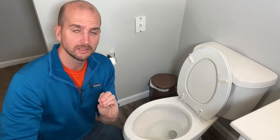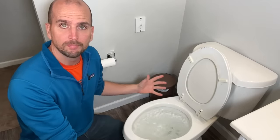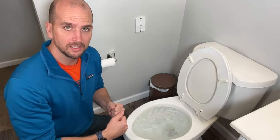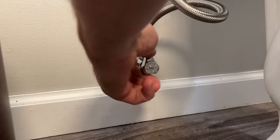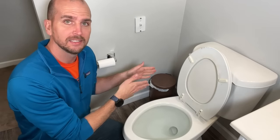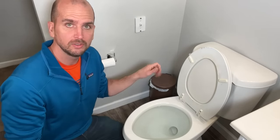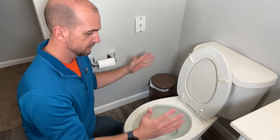For step two, what you'll do is turn off the water immediately. Let me demonstrate that on this toilet. That's that 1.6 gallons going in, and once that's done you'll see it's going to continue to rise. So what I'll do is turn off the water here, which is usually located on the left-hand side and is either a quarter turn — like the one I have, which I prefer — or a multi-turn. In this scenario, we've stopped and do not have additional water going into the bowl.